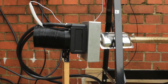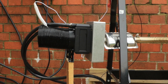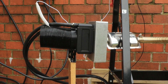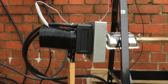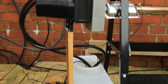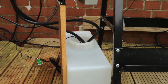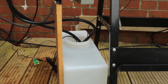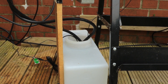Onto the front of that we've got our 80mm heat exchanger, and there we've just put one of our adapters and a standard piece of ducting that allows us to insert a temperature probe — which is the white probe you can see there — to measure the temperature of the exhaust gas. If we bring the camera down we can then see the silicon hoses coming out of the heat exchanger. They come from our 12 litre water tank. There's a pump in there that allows us to measure the temperature and to see how much energy we've been able to recover from the exhaust gas.